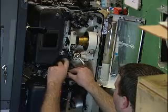Every time the shutter blade clears the path for the lamplight, the Geneva movement has stopped the film in place, and we see an image. And then while that film is in motion to bring up the next frame, the shutter's going to block the light so we don't see that ghosting effect.